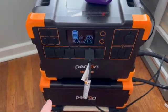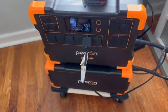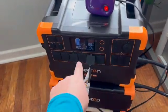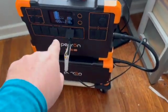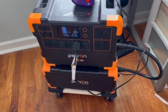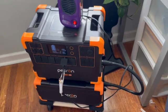Charge them all individually, connect the cascade cable, get them all connected, then plug your AC charger into the unit again, let it get up to a hundred percent, unplug the AC charger, flip it on, and it should work. My issue was that even though both units were fully charged, I didn't realize you had to plug in the AC charger again to get them cascading. I thought it would do that automatically just by connecting the cascading cable.